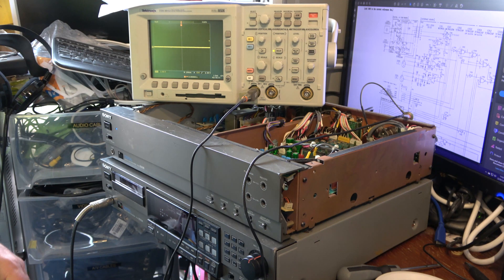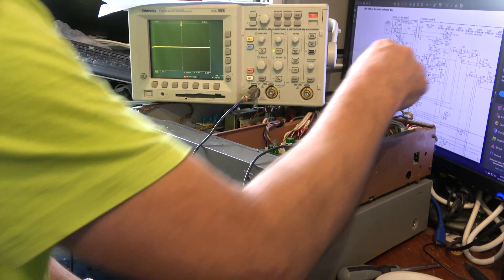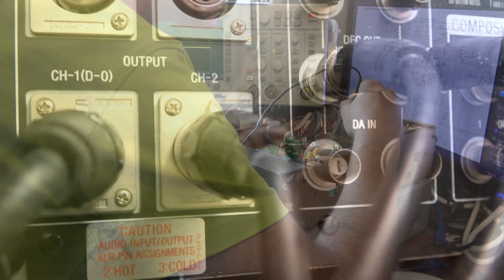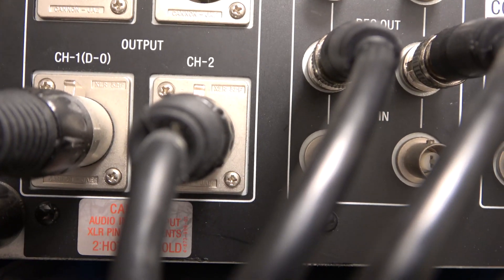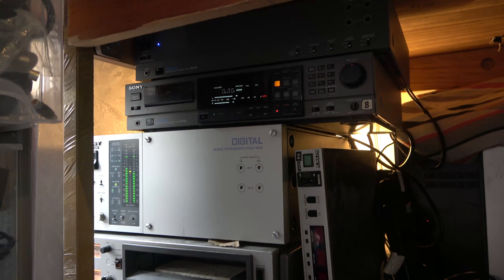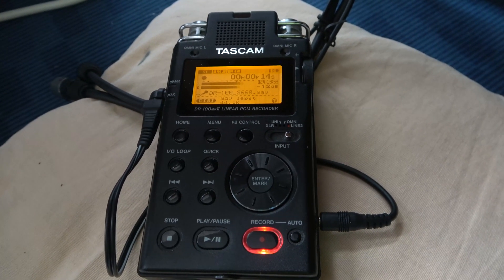In parts 1 and 2 of this series, I set up and modified a Sony PCM2500A and B set DAT recorder to act as a go-between between the obsolete and obscure SDIF-2 digital output of a PCM1630 U-Matic-based digital audio system and a modern digital audio recorder which requires the S-PDIF digital input.